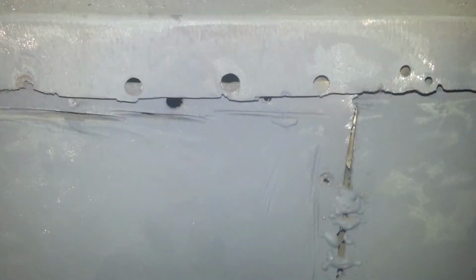The bodywork was just horrible. The metal work was horrible. No flanging tool, nothing. If you're going to put it up under something, at least flange it. This was a perfectly good panel, mind you. Brand new Sherman panel. The guy I bought it from gave it to me. It should have been that easy, just pop it on.